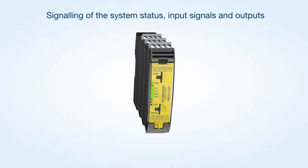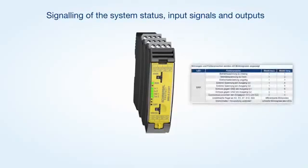The in and out LED signal that the feedback circuit is not closed or that the system is waiting for a start signal, as well as the status of the safety inputs. Faults in the wiring, such as a cross wire between both channels of a safety switchgear, are signaled by the error LED emitting a flash code. In this way, the LED indications provide uniform information for the electrical circuit of the connected sensor technology and where the fault is located.